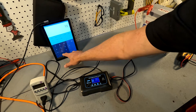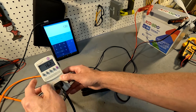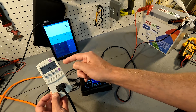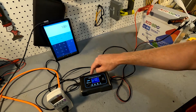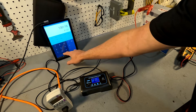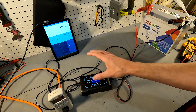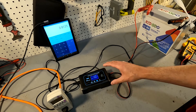Let's go ahead and put that in our calculator, then we need to look at what is being used straight from the outlet. It shows it's fluctuating between 159 and 161, so we're going to say 160 watts. You divide 130 by 160 and you get an 81.25% efficiency rate. That is the down and dirty way of doing it — it gives you a pretty good estimate of what you're going to be getting from this charger. You're only going to get 81% of the juice going into this battery from your source.